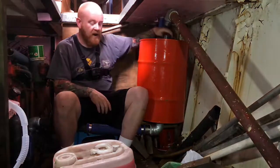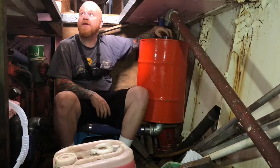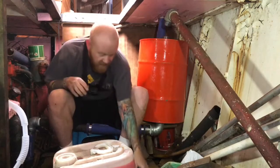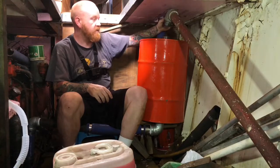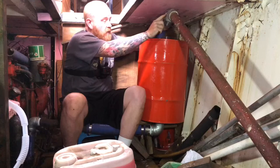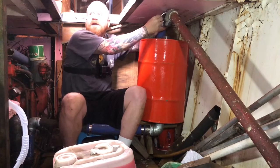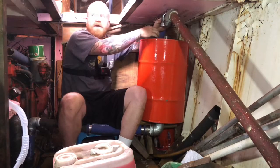Too low. So you want to get a coupler that's 6 inches long. I'm pretty sure they have them. You get a 6-inch long coupler, then you have that on, then you have your 90, but your 90, you see, would be up here. Then once this is out of the way, you put this little coupler into the 90, so this coupler is still good, because this would go into the 90.